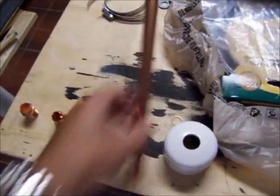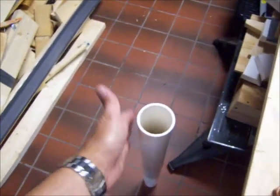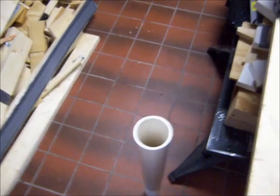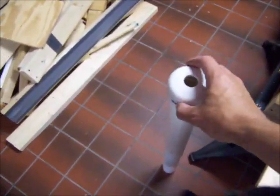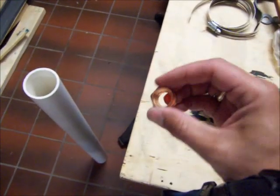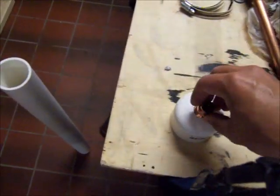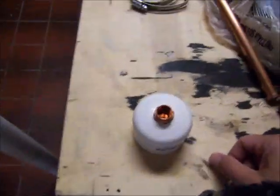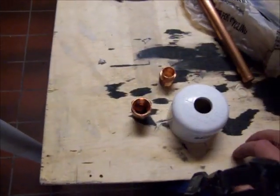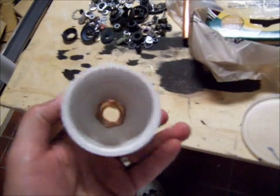The way this is going to work for mounting — I want to have the antenna mounted right in the middle of the top of the pole rather than hose-clamped to the side. I want to keep this vertical thing going. It looks prettier and seems more balanced. Here's my thought — I haven't tried this yet. This is the cap that will go on the top; this is just a scrap piece I'm using for testing. This will be soldered on to the base of the J-Pole, will sit inside of this, and then screw down with a washer under it.